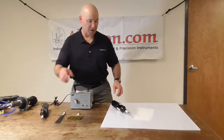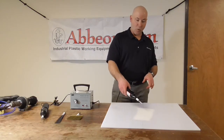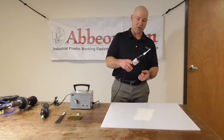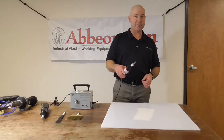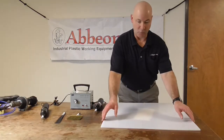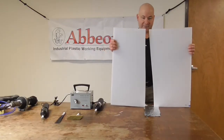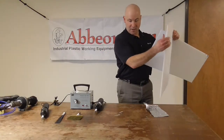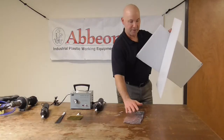When you're using this unit, you're going to hold it about one inch — the electrode has to be within an inch of the electrical component or the piece of metal that's going to conduct the part. Now what I've done here is I've cut this piece of plastic in half and we're going to weld it back together. But underneath I've got a piece of aluminum foil — that's my conductor there.